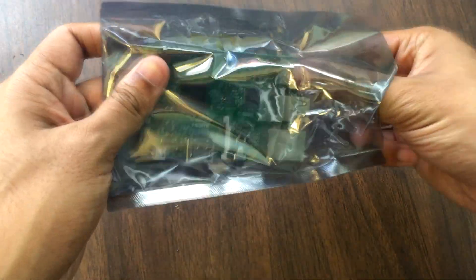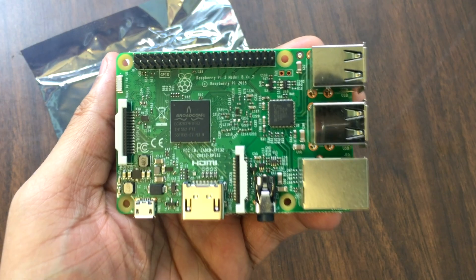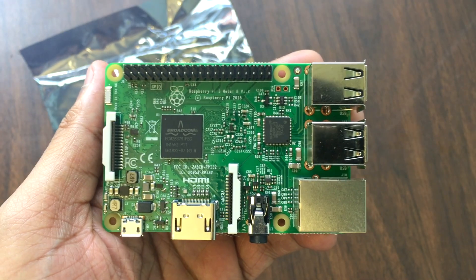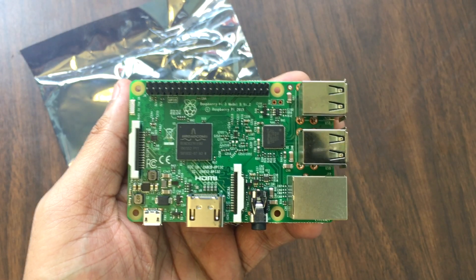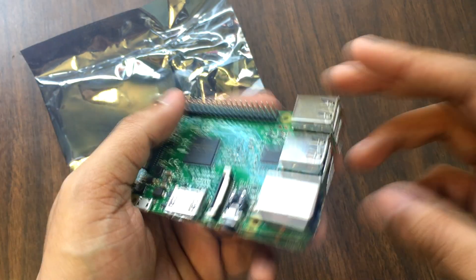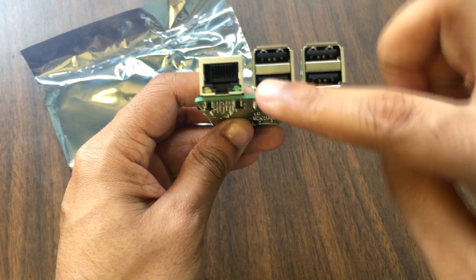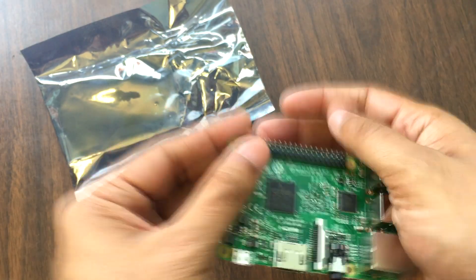So let's get to the main part of our video — the Raspberry Pi 3. I'm very, very excited to work with this thing. I've worked with the Raspberry Pi 2 a lot and have had tons of projects on it. The device features a quad core ARM Cortex A53 1.2 GHz processor as well as 1GB DDR2 RAM. And damn does this look good. It looks very similar to the Raspberry Pi 2 but has some cleaner edges. It features 4 USB 2.0 ports, an ethernet jack, and if we look to the side it has a 3.5mm audio jack and the HDMI out.